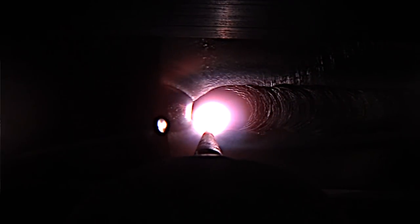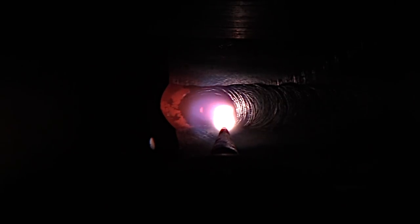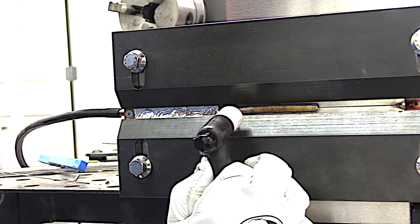I was lucky enough to get a pretty good arc shot here. Tying into that very end tack — as soon as it ties in you want to let off the pedal a little bit, then really watch it close and back inward a little bit as you taper off. All right, let's get back to the positioner weld now.